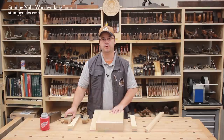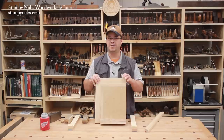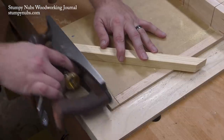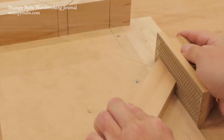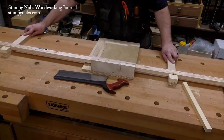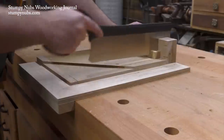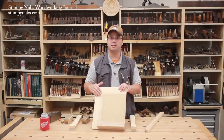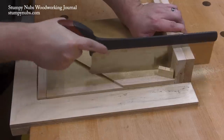Now a little bit about the shooting board itself — I made this a few years ago and we have plans on our website linked below. This is unlike other shooting boards because it's a shooting board and bench hook combo, meaning it has 90-degree and 45-degree fences, plus kerf guides in the rear fence so you can make your cuts then use the shooting board to fine-tune them. The edge hooks on the front of your bench like a traditional bench hook, with extension hooks for supporting long boards. The fence is replaceable if it gets chewed up, and so are the flat base panels — keeping your cuts nice and crisp.